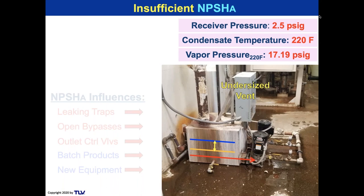You know, you can take a tank, let's say it's a 45 gallon tank, and you could figure out how much is being pumped there. It looks about 10 gallons, you know, 12 gallons in cycles, something like that. So if you had a larger receiver that was elevated, you could drop that level and you would get a lot more in a discharge cycle, and that would make the pumps last longer.